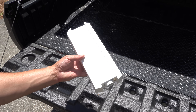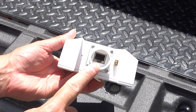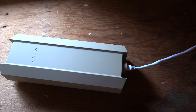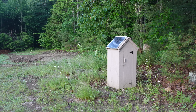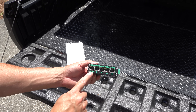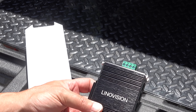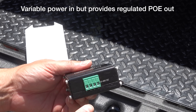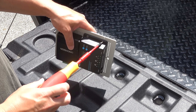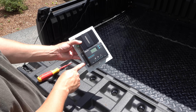Here's the access point I'm going to use down at the station — the same TP-Link outdoor access point I used at the garage. Now for the biggest challenge I faced: these devices want to be powered using power over ethernet, but power over ethernet requires 48 volts of direct current. Your solar panel is typically putting out a lot less than that and it will vary. I needed a network switch that could regulate the output. There are almost no network switches on the market that can do this. I searched for almost two weeks and finally found this LinoVision product — it sells for 99 bucks and does exactly what I need. I'm using a project box to mount the small solar controller and the network switch, using its pegboard to screw the devices in.